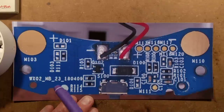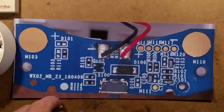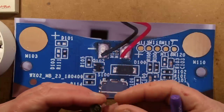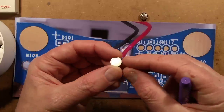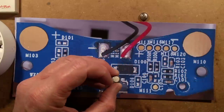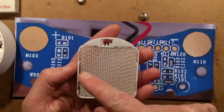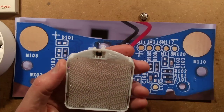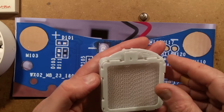I'll make a wild guess that this resistor is in the vicinity of the contacts used to monitor the battery in the cartridge. The battery in the actual cartridge is marked as an LR44, which is a standard battery — a Maxell LR44 — but it's got this strange extra dome on the front that's unusual. I've got the nearest equivalent I could find, which also says LR44, so I guess that will be a pretty good equivalent, and I'm going to try it in.